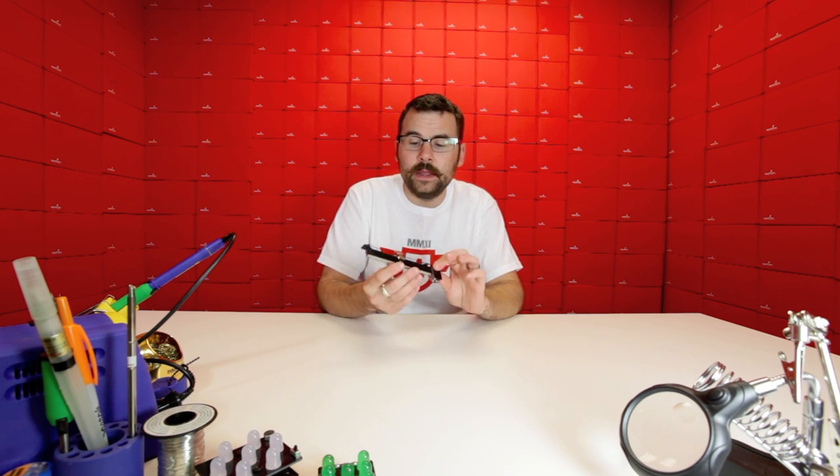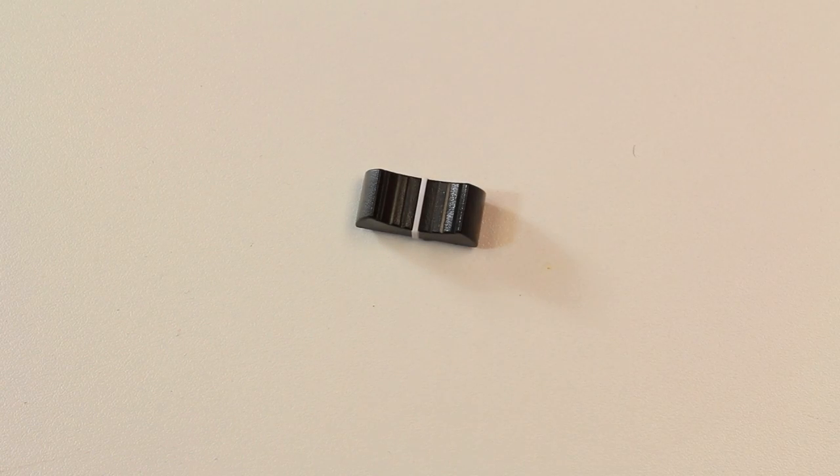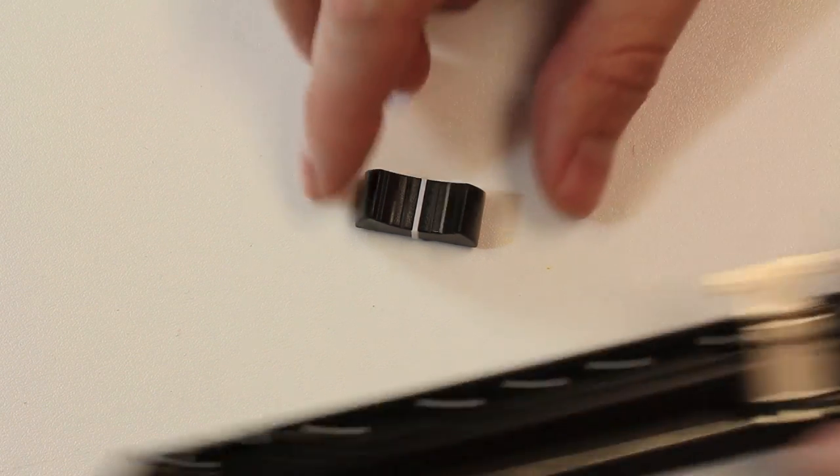These are really cool because you can precisely control the position of the slider. We had demos where we would set the slider at a value, press a button to record the analog value, move it, then hit another button and it would recall back to that level. These are the things found in recording studios with monitored motorized fader levels. We also have a knob to fit these, since it does have a bit of a weird connector, so we've got a knob that fits directly onto it.